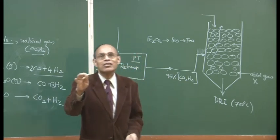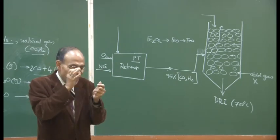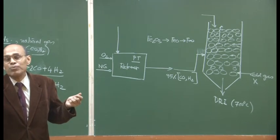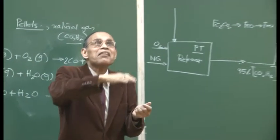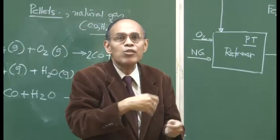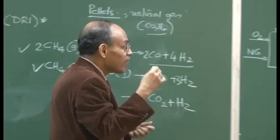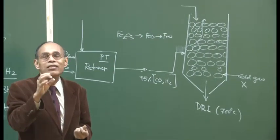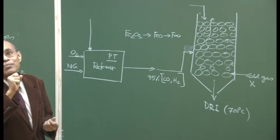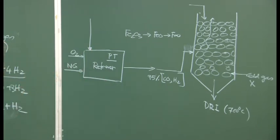One of the major problems of energy wastage in the steel industry is that we get the raw materials at room temperature, and we sell the finished product at the end of the process also at room temperature. But in the process, there are a number of cases where it is taken to a high temperature, then cooled down, then again taken to a high temperature, and in that process there is a significant loss of heat energy. Today, the increasing thrust in the steel industry is to minimize such heat loss. So wherever there is scope, trap that heat, which was earlier being lost to the environment, and utilize it in running a part of the mill, maybe your rolling mill, the blast furnace stoves and so on.